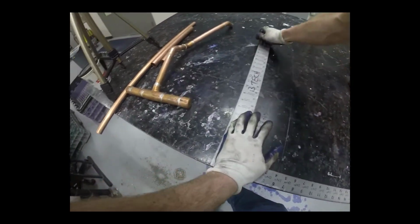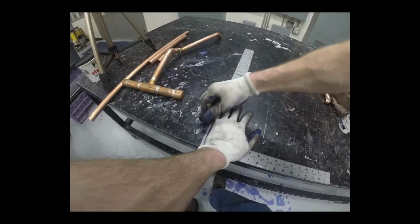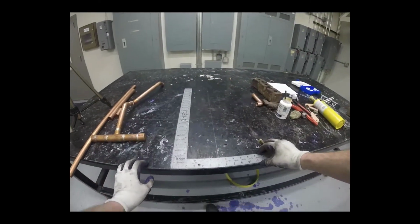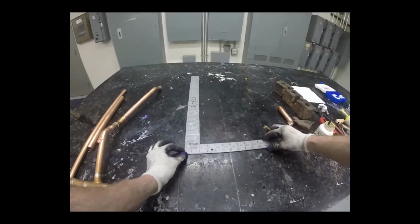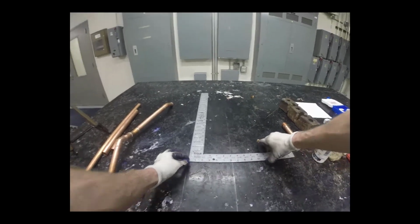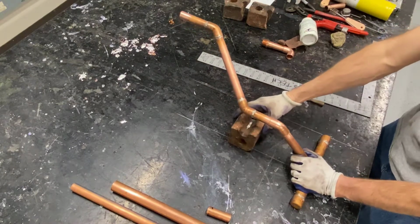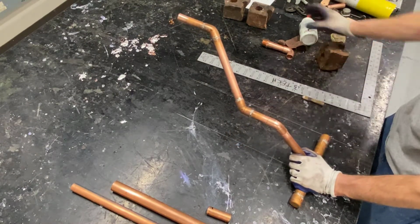I'm going to move that square over. My offset is 6 inches, so I've moved the square 6 inches, and I'm marking another line. Okay, follow me here. If center to center on a pipe is 6 inches apart, then the edge of the pipe would also be 6 inches apart. That's the principle we're running off here.